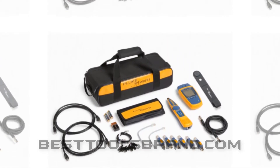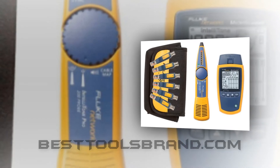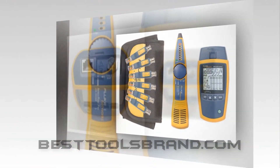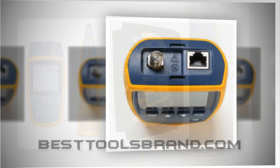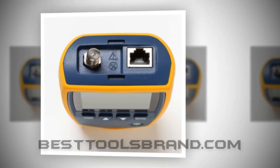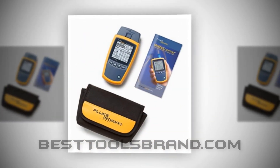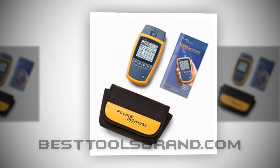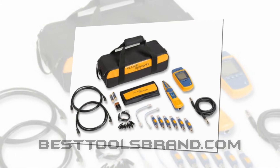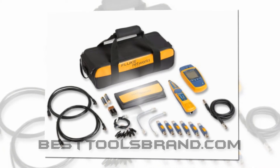It comes with a streamlined verification testing system. While running a test using this kit, it takes tests from four different testing modes: wire map, cable length, cable ID, and fault distance. After completing the test, it shows results on its oversized single screen. The LCD backlit display is crystal clear even in bright sunshine. The integrated RJ45, RJ11, and coax cable testing ports provide full support to the testing unit to test any kind of low voltage cable without using any awkward adapter.